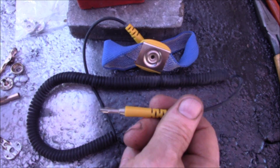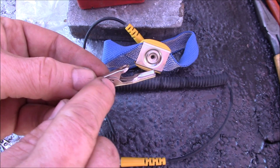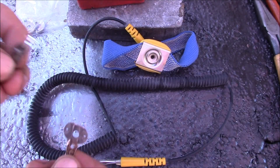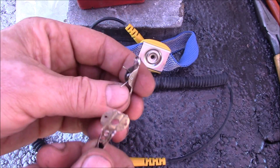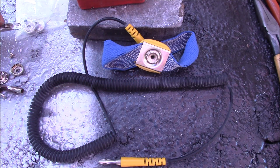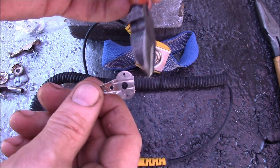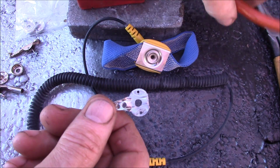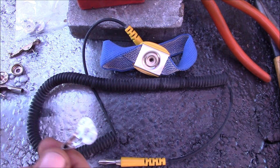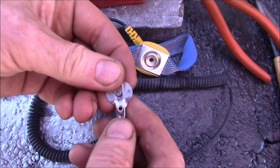What I'm going to do is take one of these alligator clips and turn it into a snap, because I like being able to clip it onto something when I can't use my bench. What I did was take one and grind off the head and bottom of the little rivet, then pop the rivet out. Then I took the other half and used my cutters to cut off the tooth part of the clip, hammered it flat, and drilled a little hole in the middle.